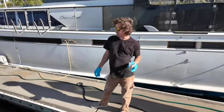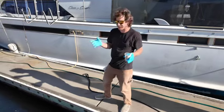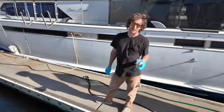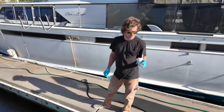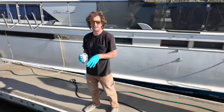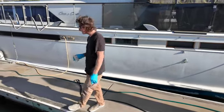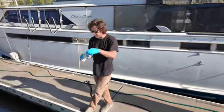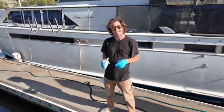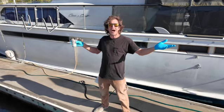There's no signs of real rot, but it was a little bit wet wood there. It wasn't sealed at all, so throw a little bit of this filler over there. It's kind of wet, so it's sealing nice, and leveling out nicely too. Just glob it in there with the toothpick or popsicle stick, and voila!